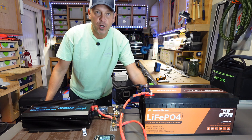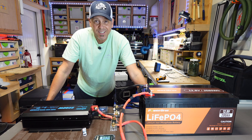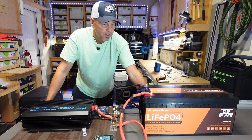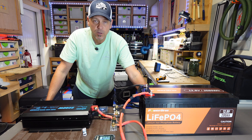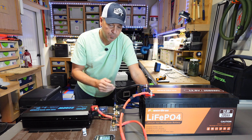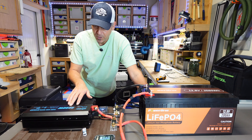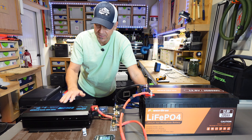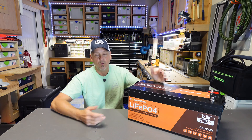I'm going to cut this off now because it's getting warm in here. So we were going strong for about nine minutes at around 220 amps — that is a lot of current going through this battery powering these heat guns. As you can see, this PowerUrus can handle it. It does have that 200 amp BMS, so it has enough horsepower underneath that lid to run quite a bit of large equipment or appliances. Again, if you're going to do that, make sure you have much thicker gauge cabling. Overall it worked really, really well. I'm mainly surprised this 2200 watt inverter was able to handle 2700 watts for five, six, seven minutes — she is definitely warm to the touch, but it worked.